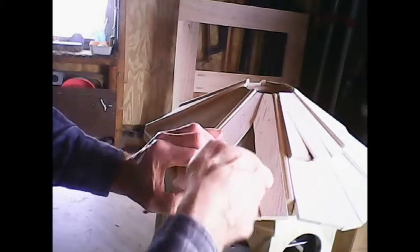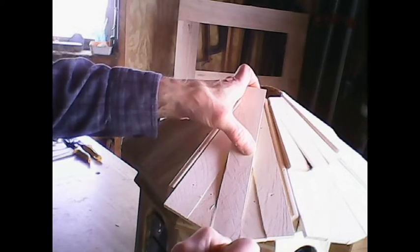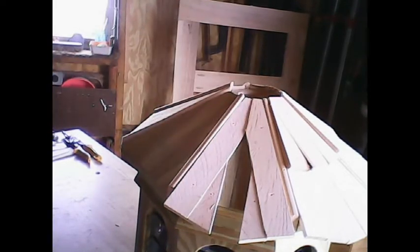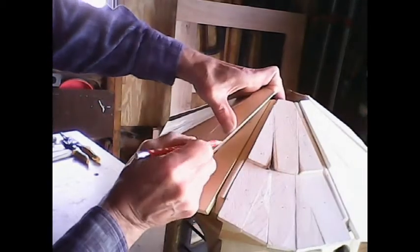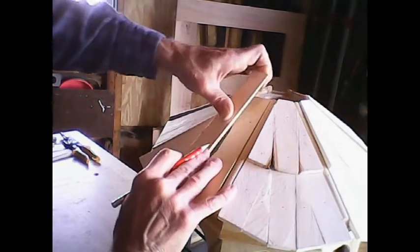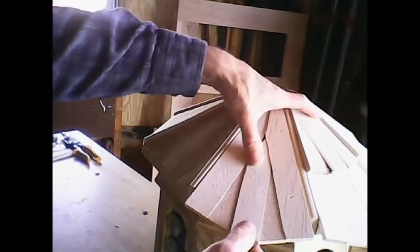I go a whole lot slower whenever I'm not doing a camera shot so I can really take my time, but right now I'm trying to keep the tension here without getting boring. Lastly I'll fit this in here — find out where it fits, come down about there. That will be where I cut across. I fit this in where I want it, see where I'm touching here and here, rough it in, then glue and nail it in place. These are contractor shims.